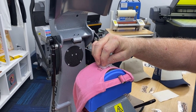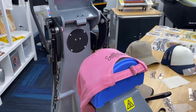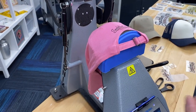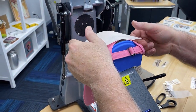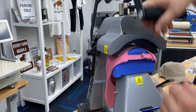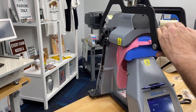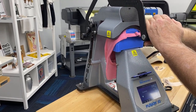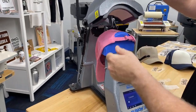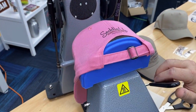Let's go ahead and get this peeled. There we go. Now I'm going to take a finishing sheet — this is a piece of a finishing sheet we would use for DTG or other things like that — and put that over top of it. We're going to give it another five seconds at heavy pressure. What this does is it sets the glues a little deeper and it's also going to improve the rub fastness of the transfer itself.